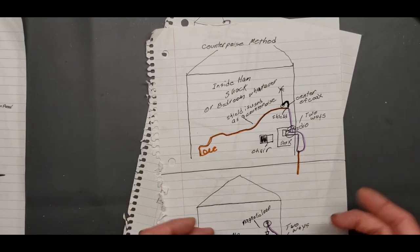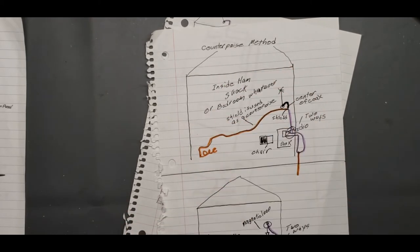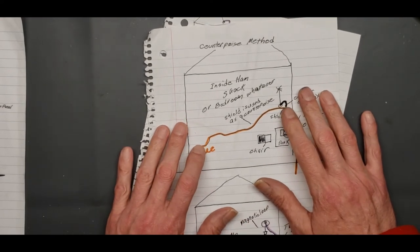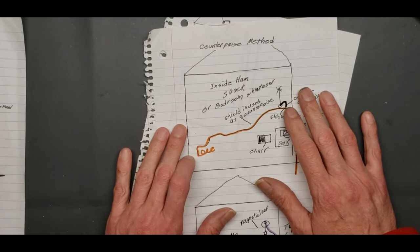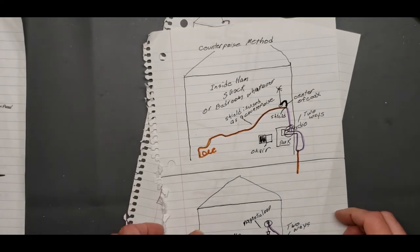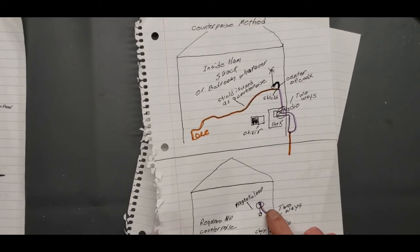And I know if you can't get it to a ground, the counterpoise is it. A lot of guys are using big metal plates with magnet mount antennas and grounding to the metal plate, using the magnet to ground to the big metal plate. That helps take away some of the noise. But you've got to do what you've got to do for your situation. I would seriously think, if you're inside and looking for something to receive, you can look at these magnetic loops too.